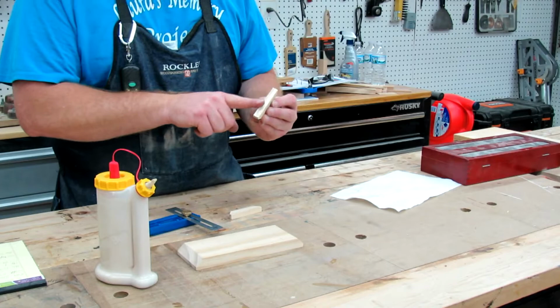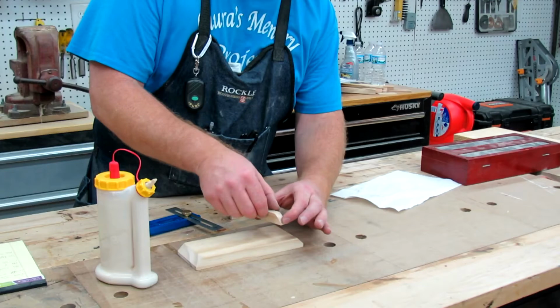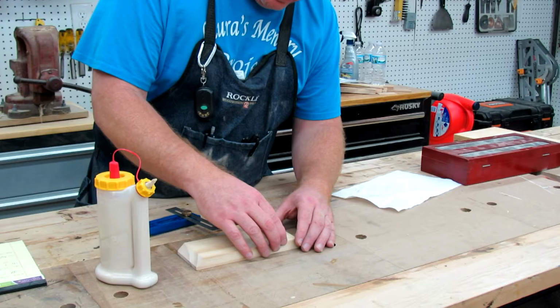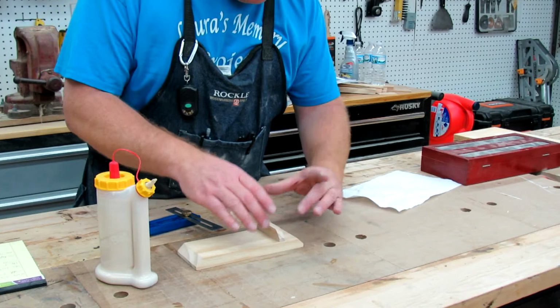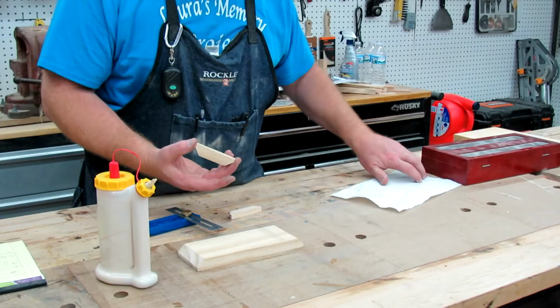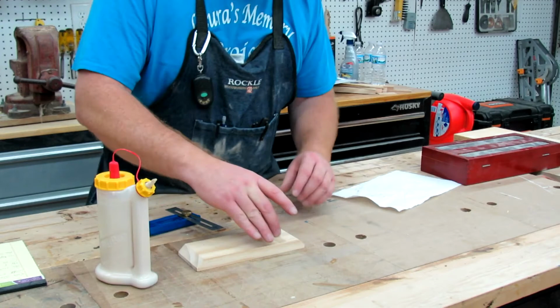and you're just going to take this and you're going to put it right on the line, on the inside of the line, right at the inch and a half. Give it a slight wiggle. Looks like I put way too much glue on that one, huh? Well, if you put too much glue, just go ahead and pop it up real quick and clean that up, because this will just save you a lot of work later on. And then put it back in place.